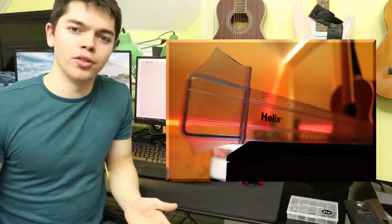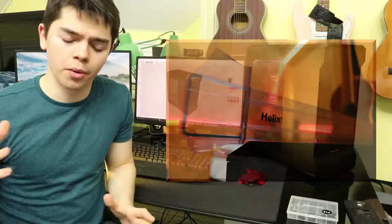Just to go into the accuracy of the model so you have some legitimacy as to how well it's made: to get the best model accuracy I could, I used a digital vernier caliper accurate to 0.01 of a millimetre. That covered all my measurements from 0.5mm — the smallest I came across in the case — all the way up to 150mm. For measurements above 150mm up to around 450mm, I used a mostly unbroken ruler — it doesn't affect the measurements. Based on that, I'd claim this model has a rough accuracy of about one millimetre.